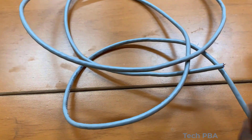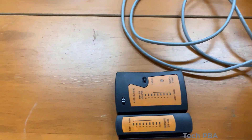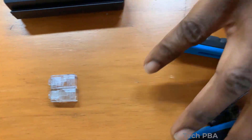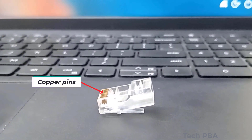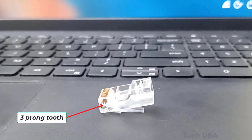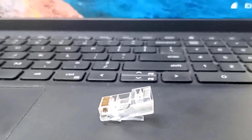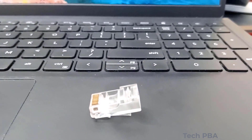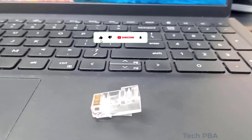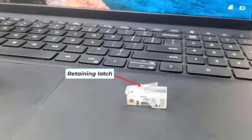We're using a CAT6 network cable. First, we'll learn about the various parts of the RJ45 connector and the roles they play. We have eight copper pins, and each copper pin has three-branch teeth which are pushed into the wires when you terminate them. We also have the strain relief, which after crimping will sit on the outer cover of the cable to make it firm.